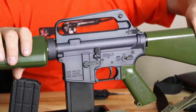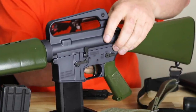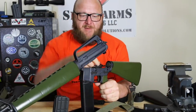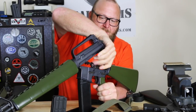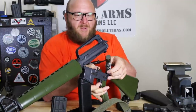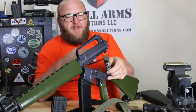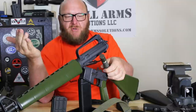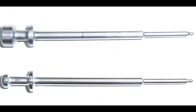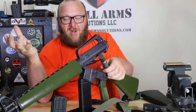Some other parts I added inside this rifle for authenticity: the buffer. As it came from Brownells, it had a standard mil-spec type buffer. To get it where it needed to be, I utilized the original Edgewater buffer assembly — really more of a spring guide than a true buffer, as it doesn't have the sliding weights required to work with ball propellant. The one change I made because I wanted this to be a shooter: the original firing pin was an oversized firing pin. I changed that out to a standard one so I could use the rifle with modern ammunition.